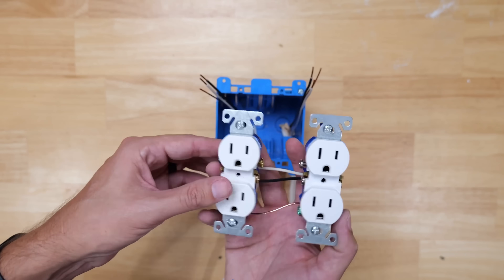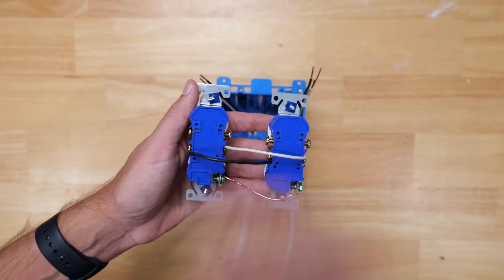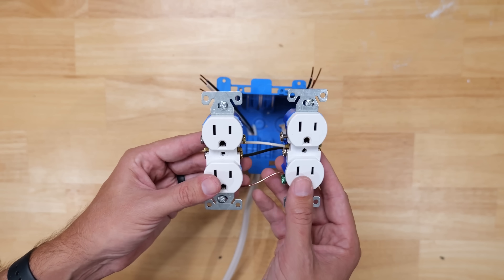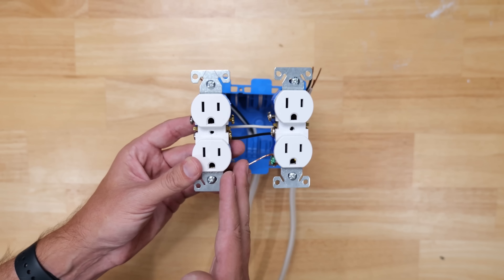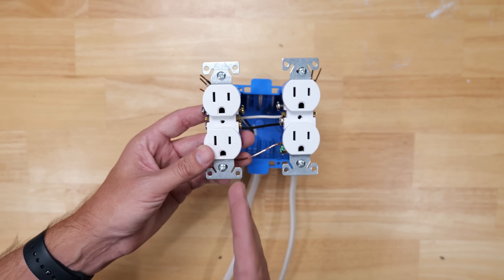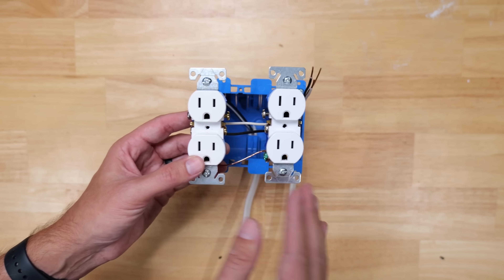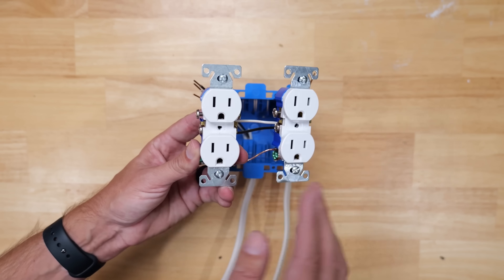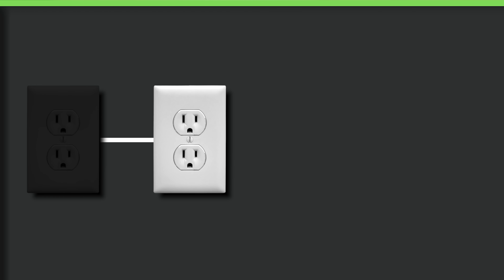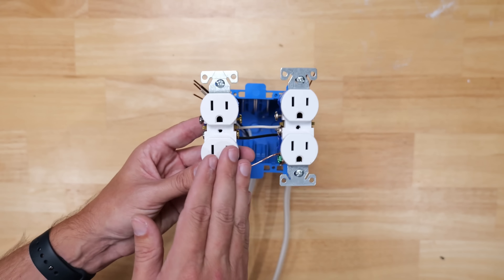When wiring multiple things in a box, this is the way most people are still doing it. Whether it's one receptacle or two, the idea is the same — we're using the receptacle as a pass-through to feed power on down the line. While this is still legal and many electricians still do it, in my opinion it is not the best way. One key reason they're moving away from this: if a device fails and it's passing current to the rest of the circuit, the power stops going to everything downstream, including your lighting circuit.